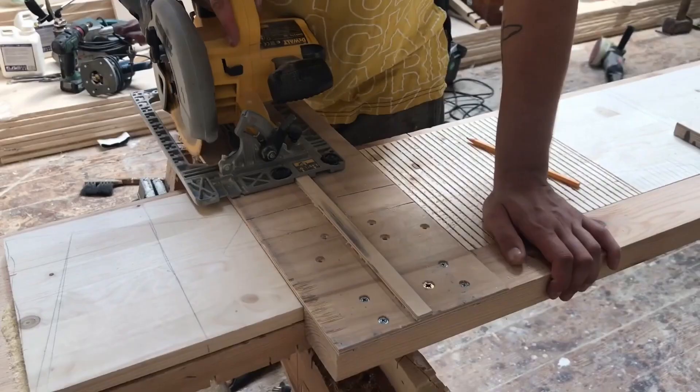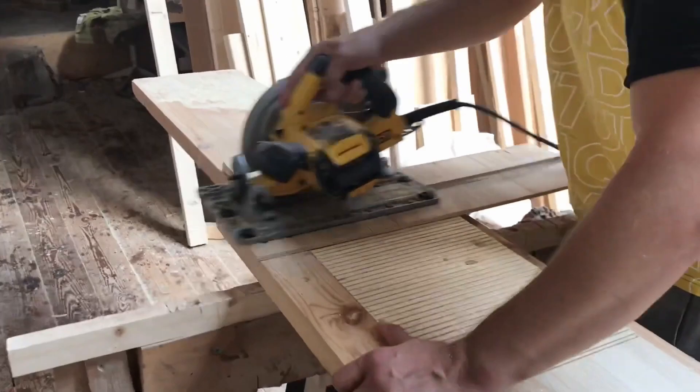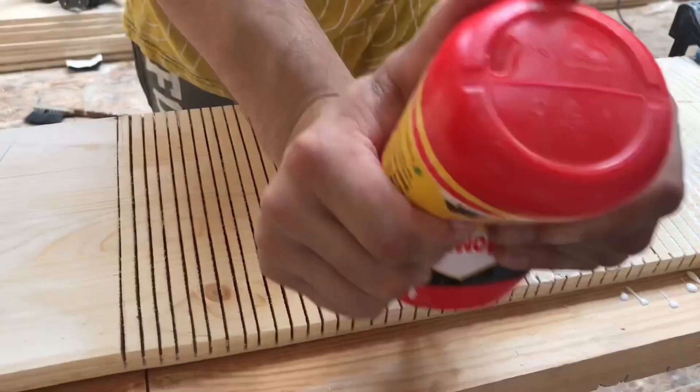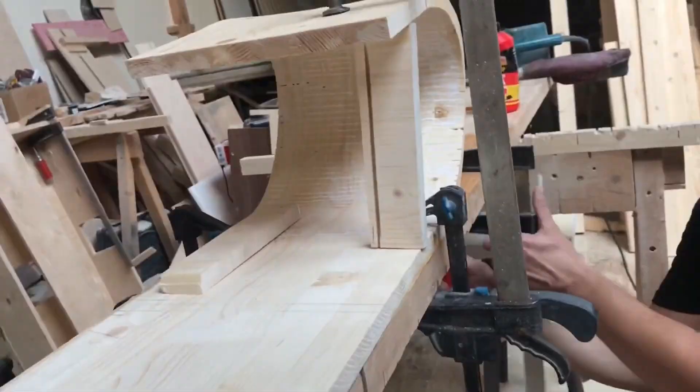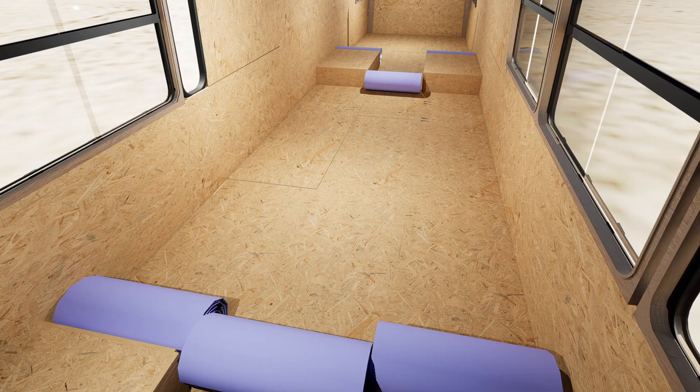You may wonder how to make curved particle board. First, make cuts at 80% of the material thickness every centimeter on a saw. Then the wood can be easily bent. Finally, fill all the joints with glue and let it dry in the desired shape. Alternatively, you can simply order the particle board you need in the required size — the prices are not so high that you have to make it yourself.